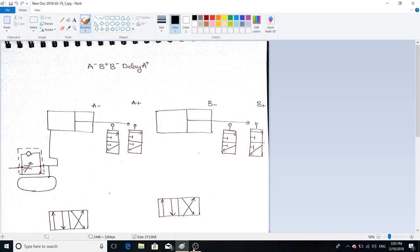Hey guys, welcome to my channel, The Mechanical Engineer. Today we are going to see a pneumatic circuit. The sequence of operation of this circuit is A-minus, B-plus, B-minus, and we are going to delay the motion of A-plus. For this operation we are going to need two double-acting cylinders — cylinder A and cylinder B — and four sensors. These are 3/2 valves which are going to sense the position of the piston.